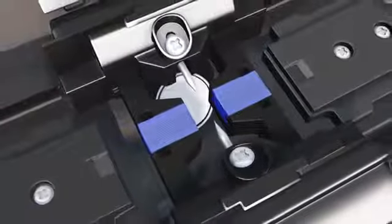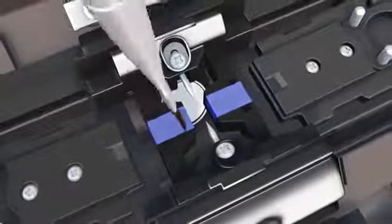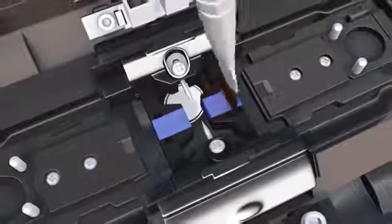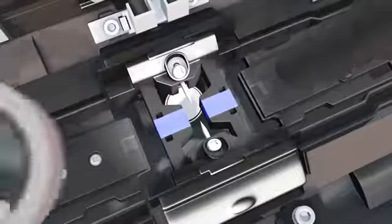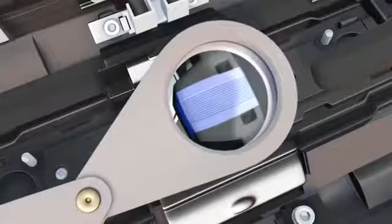Using the sweeper brush, gently sweep the remaining debris from the v-grooves. Start the sweeping motion at the edge closest to the electrodes and move to the outside. Inspect the v-grooves and repeat the cleaning process if debris is still present.